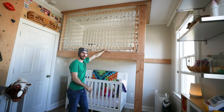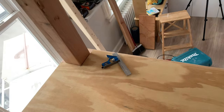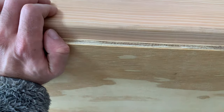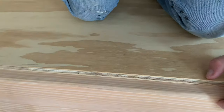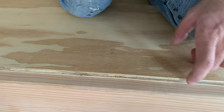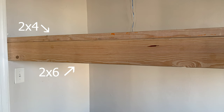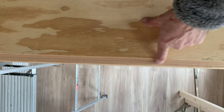First, the plywood on top that the bed goes onto. Okay so day three, plywood day. Yes I'm filming this with my phone - I'm a professional YouTuber, I know what I'm doing. The trick I'm doing with this plywood is I don't want this end to show like a plywood sandwich. What I'm gonna do is stick another piece of two-by-four but I'm gonna cut a channel in it so the plywood fits in that channel and then this sits on top of this wood here, so you don't see the edges of the plywood. That's why I cut it a little bit in from this so that there's a channel over here, and then I'm gonna do the same thing over here and make a channel over here.